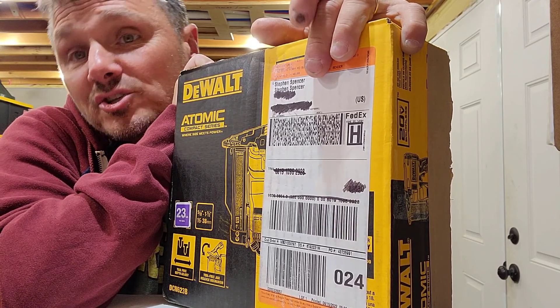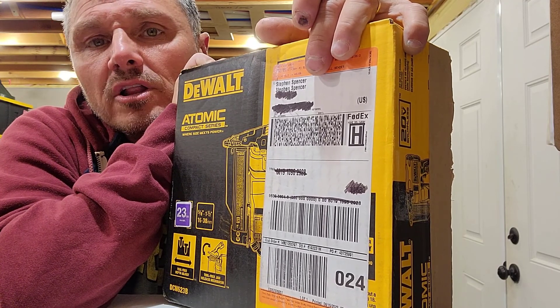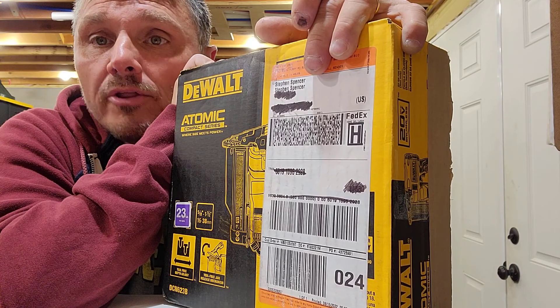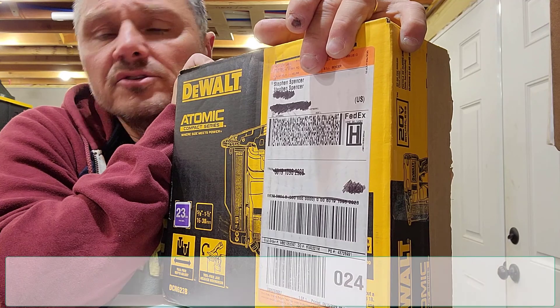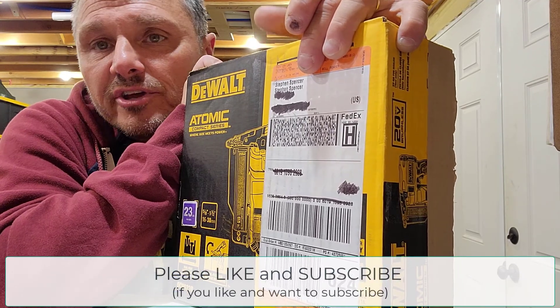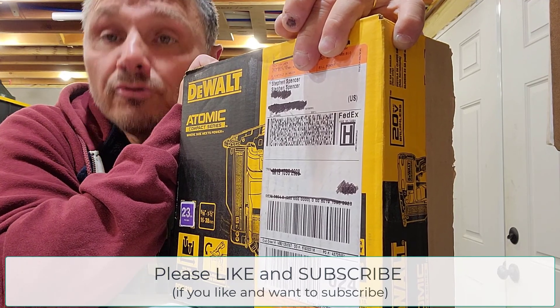What instigated this tool is that we are in the final phase of a remodel of a kitchen and family room. We opened up a wall that was non-load bearing and made it all one space, re-rocked with new insulation, furred out the wall so we could get 2x6 insulation in there — high density R23 — and all kinds of other things. New kitchen.